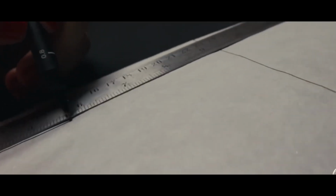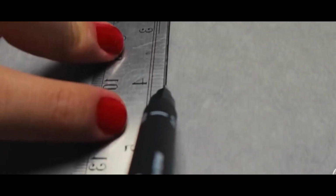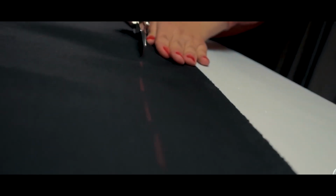It's basically where we get a piece of fabric and we create the garment pattern, which is the shape of the product. We lay it out on the fabric piece and we cut it out and then we sew it together. With seamless, it's more of a machine made. The fabric doesn't come ready from the fabric mill. We actually buy the yarns. So we buy the elements that are needed to make the fabric.